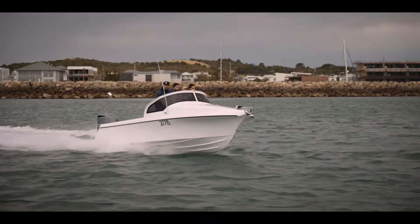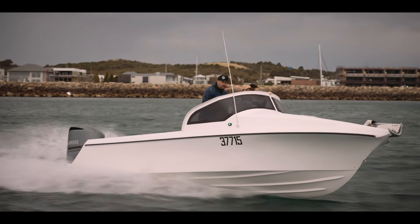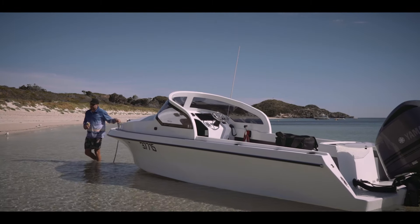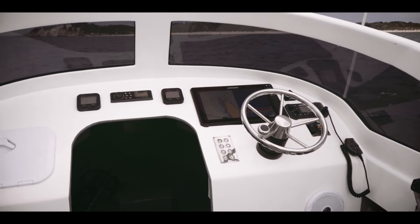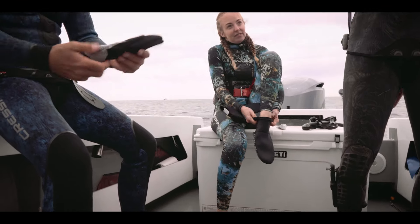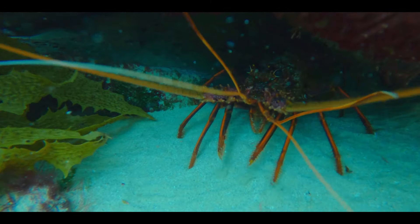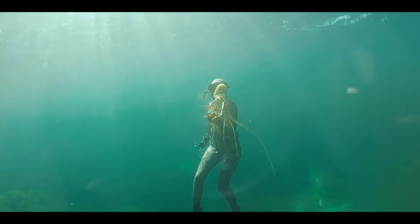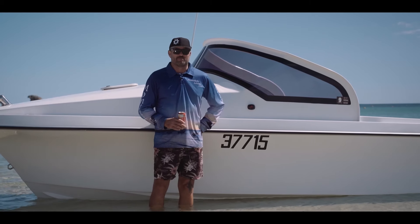The keel we extended a little bit — we could have probably extended it a bit longer, because when you start chewing up at high speeds it'll try and walk on you, so it's not for the faint-hearted. This is gel coat, so we went the extra and did gel coat — the hard yards, definitely wasn't fun. I got a friend to do the spraying and refinishing, then we rubbed it all back and polished it all up. A lot of hard yakka but worth it — it's a stronger finish, harder to chip, and can be polished up again a lot better than two-pack, it just takes a lot more labour and the costs blow out.